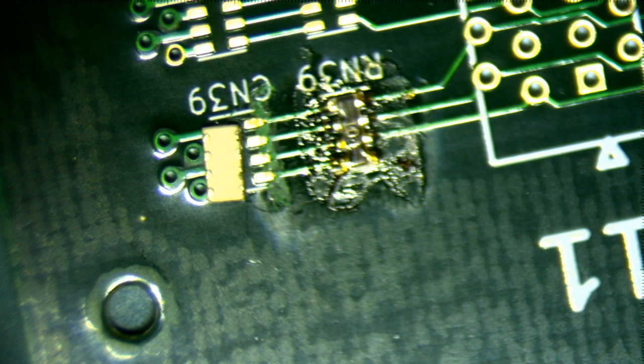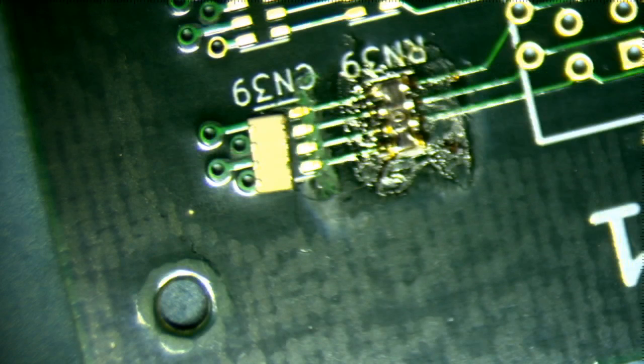Yes, I do have brass shavings. That's what I'm using. All right, let's just go ahead and remove that tip and try a different tip. I actually had good luck with this tip when I soldered up. Clean tip, flux, and don't go that fast. Well, okay, I'll try that.